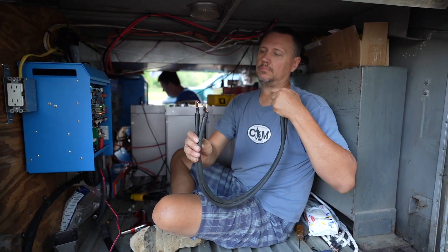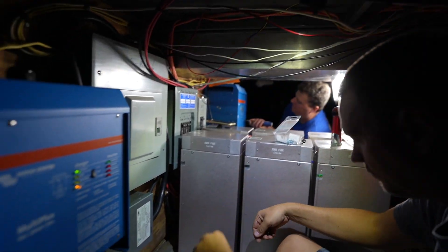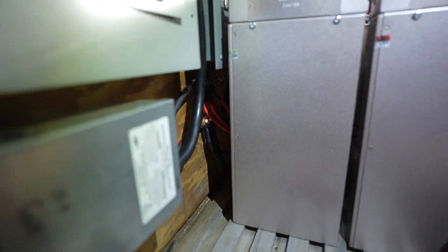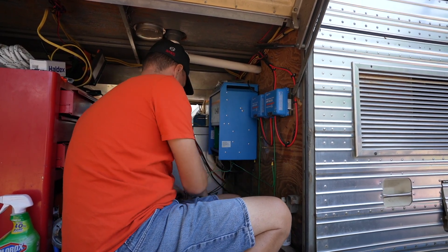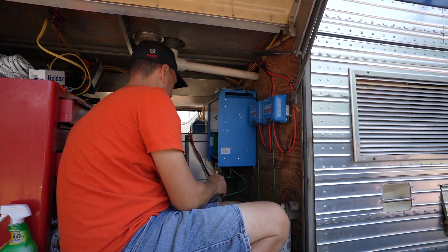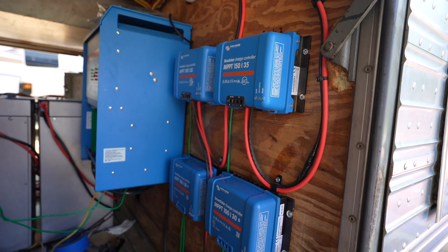RV Steve Travels is a genius. They've got the bulk of it installed — everything is installed. We've got to secure the batteries and solar isn't hooked up yet, but we got a ton of stuff done. It's a mess but there's the bar back there — that's awesome. Good for the first day. We're going to reconfigure the charge controllers because we're adding two more to this system, tearing everything apart to see how they fit. We got all four mounted, now we're going to run the wires and connect them all together to clean it up.